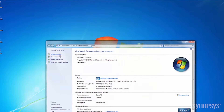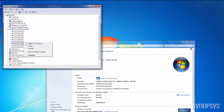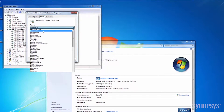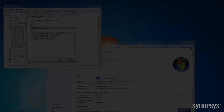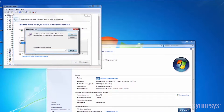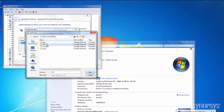After the Windows operating system brings up, Windows loads a standard PCI device driver based on the vendor ID, device ID and class codes in the PCI header. Now I will replace the standard AHCI driver with the Synopsys AHCI driver so that we can work with the application that is included in the kit.